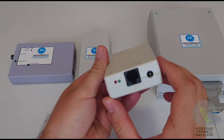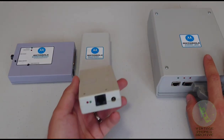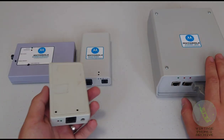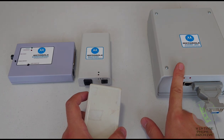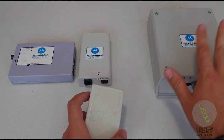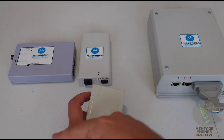This one, this is a RoEMMI 2. This was originally made by Motorola, but then later on people made simplified versions of this, like smaller ones that worked through parallel. The way this one worked, if you wanted to flash a phone, you would first put the flash onto the RAM. It's got 16 megabytes of RAM. And then the program will take the flash from RAM and push it onto the phone.